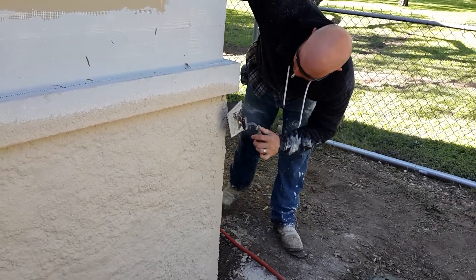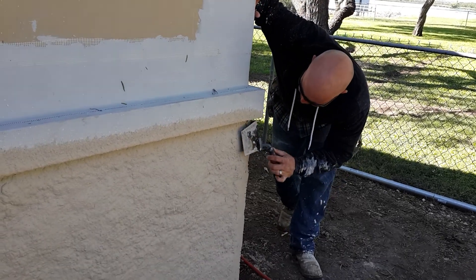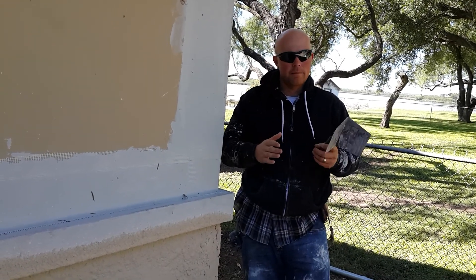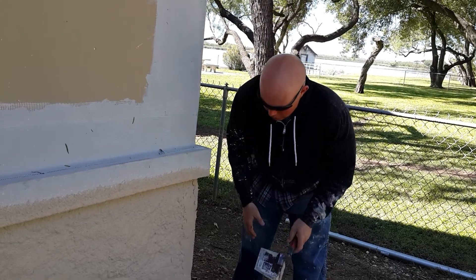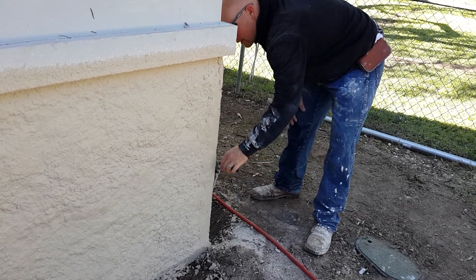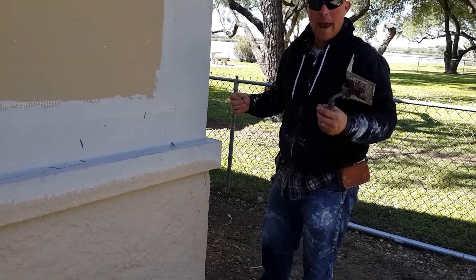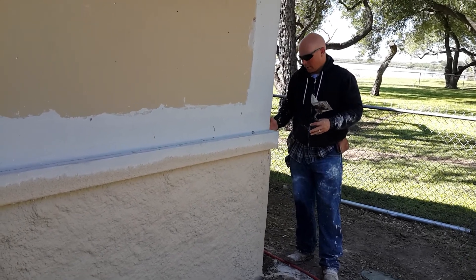You've got to be careful going down, because going down you're always pulling on the stone — you've got to be careful you don't pull the stone off the wall. But if you lightly do it two or three, four times, it makes it look real nice. Now, people say it doesn't look like stone now, it's smooth. Well, it's a lot like furring out some joints on sheet rock — you kind of have to hide it. If you'll notice, this corner, you're making the corner here, but these corners are cutting in. So take it and just rub them out on both sides, then come back with the kiss coat lightly — up and down one, two on each side — and you're in the money. It's a perfect corner, and it brings that reality of what this product can do.